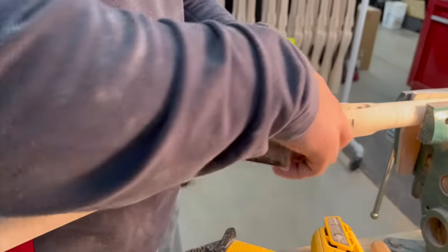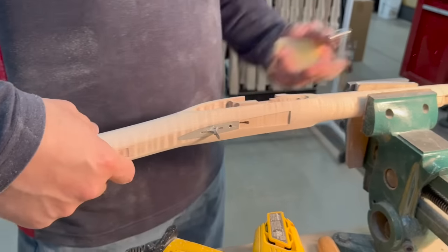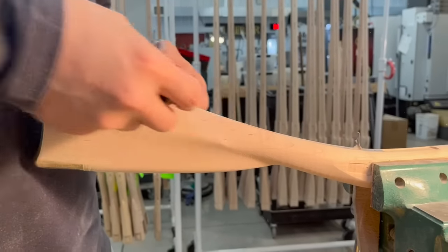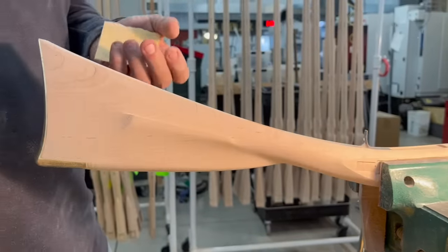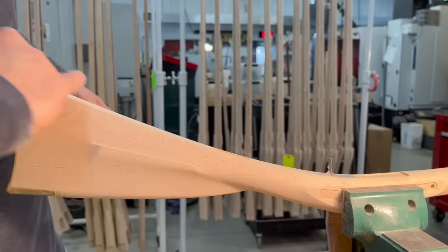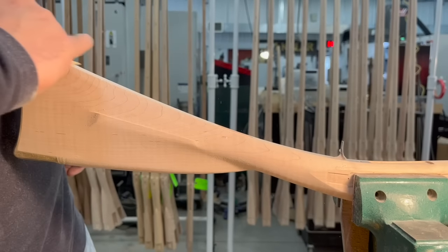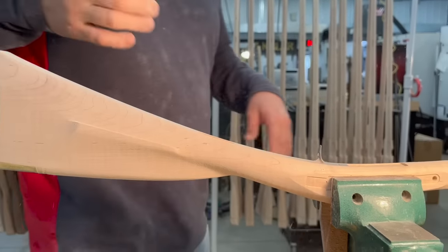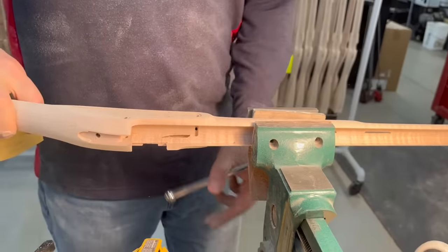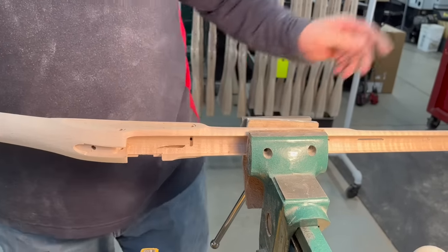This area. It's the same grit for both grain raisings? Yeah, 320 is a pretty good grit. It needs to be sharp. So it's coming along well. So I think what I'll do is I'll finish the rest of this off camera. And there's probably no need to show you the grain raising process again the second time. We'll just show you it when it's completed at the end.